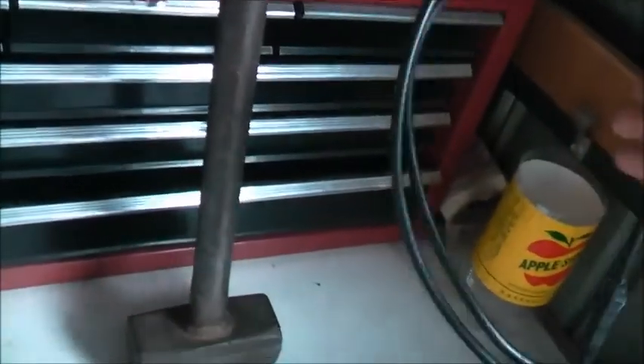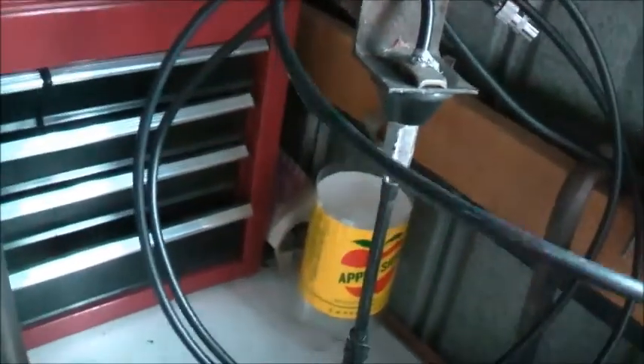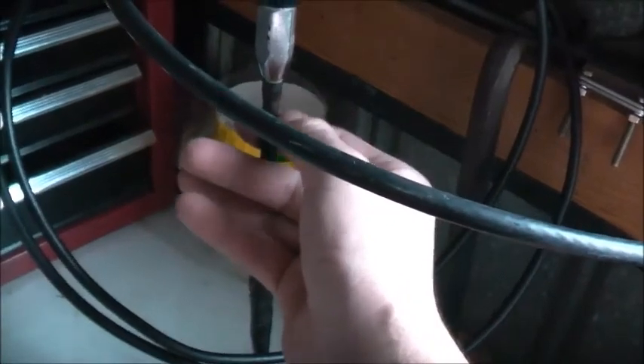Got the base on it. This base here I had in that stash. I put it on this area which I had for ages — I had this in the radio area on the camera van in the old place. The coax sheathing has a gouge but the antenna itself is okay, so I'm going to have to repair it with heat shrink and make it look good. I'll mount this up outside and test it later.